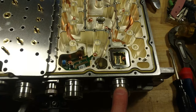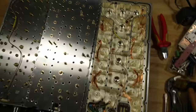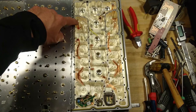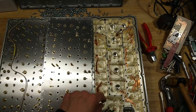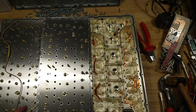The first antenna plug we have here is a TRX and RX, and the other is just RX — so we have transmit-receive and receive-only. Looking from further up, we can see that this cavity over here is only a receiving cavity, while the transmitting and receiving cavity has both a receiving cavity and a transmitting cavity with somewhat larger tuning cavities. This seems to be done in one piece, though here we actually have some tuning cavities that are machined and screwed in, while the receiving cavities are made from the casing itself.